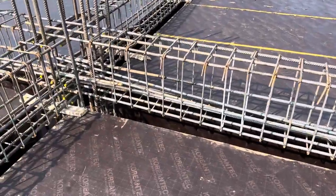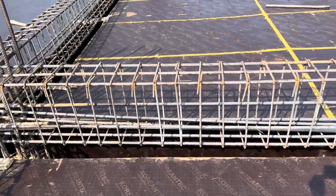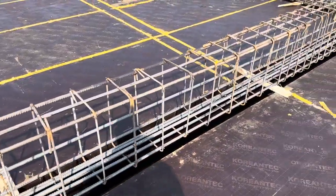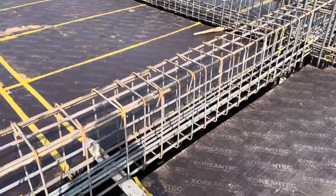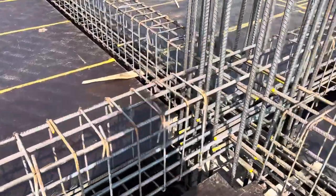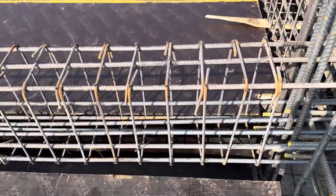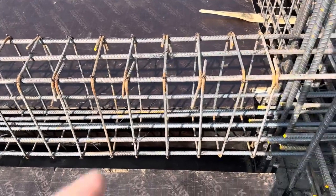I will guide you for its size, inside steel reinforcement, grade of concrete, grade of steel, stirrup size, its spacing, bottom bar steel reinforcement, top bar steel reinforcement, D/3 steel reinforcement, hook details, and lapping length. They also made some big mistakes in this floor beam, so let me show you. The size is 15 by 24 inches — the beam depth is 24 inches and the width is 15 inches.